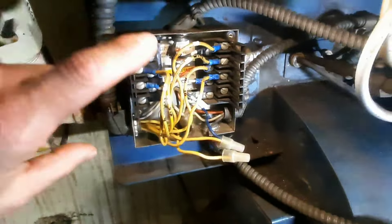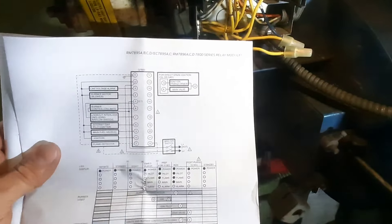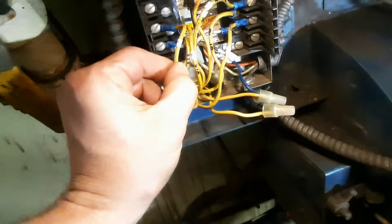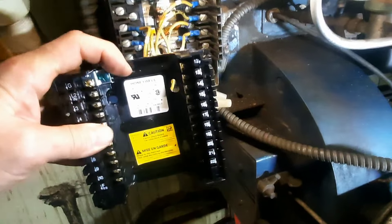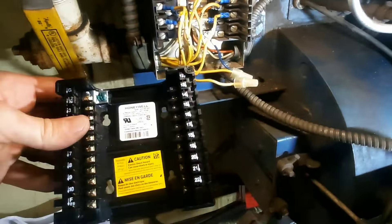I was able to find a wire diagram for the old flame safeguard, so everything is kind of backwards from what I actually got. Basically, I found I've got all the same components — this was matched up to be a compatible flame safeguard as far as time delays and everything else. This is just an upgraded model so all my numbers are changing, but once I located where everything went on my old diagram and matched it up with the new diagram, I've got my wires marked everywhere they go. I'm not sure about the new sub base because my penetrations need to be here on top or bottom, which is different from the old one.